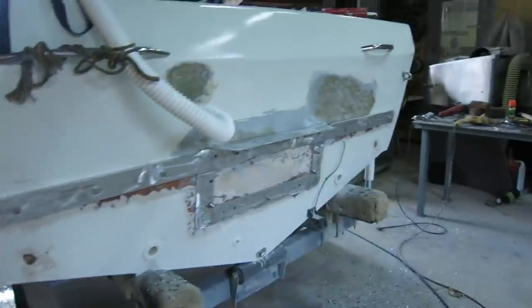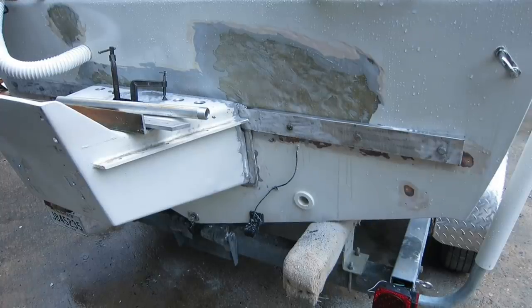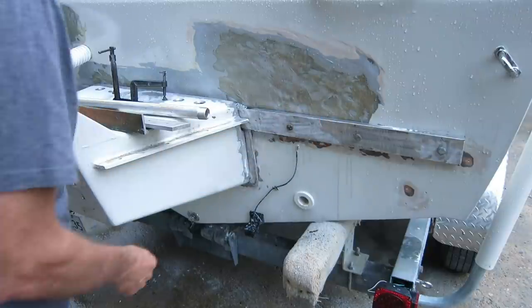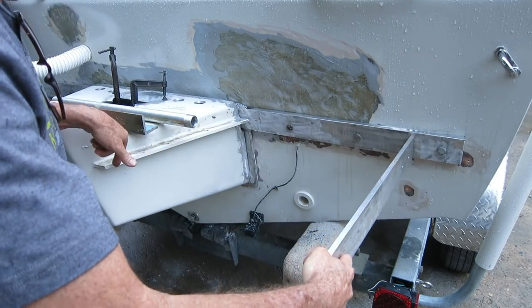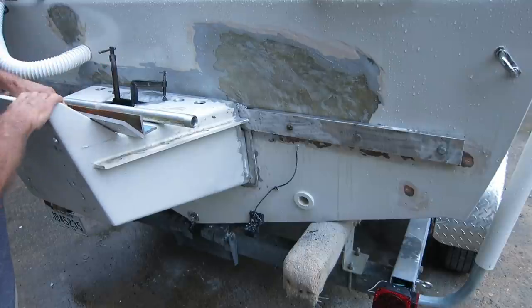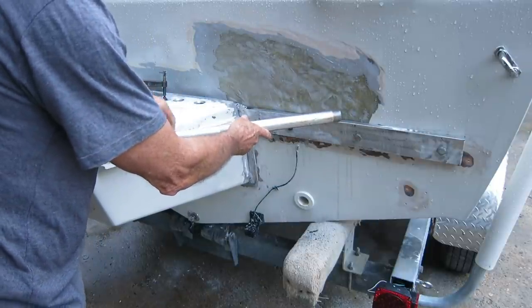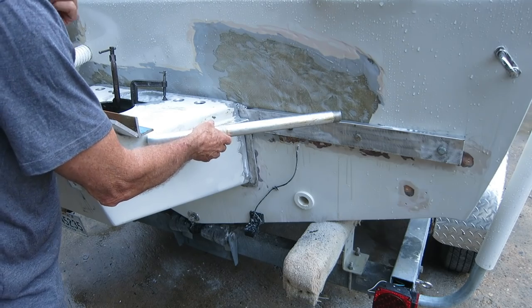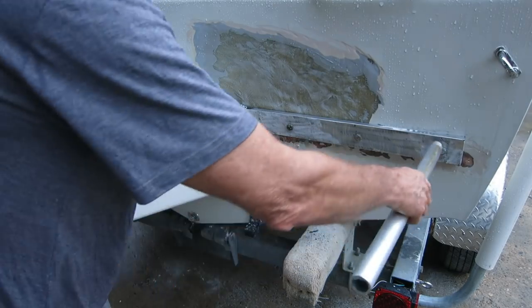It's time for a compromise to make a strong swim step. I've got this flange bolted on here — it's five-eighths of an inch thick, it's not going to flex. I could just cantilever out a couple of bars and put my curve in and I don't even think I need the brace on the bottom. But the whole point is to make the engine brackets stronger — I feel like I should come with some 45s and tie the engine bracket to this plate so that some of the vibration and thrust the engine gives to the transom will be transferred to these bolts.